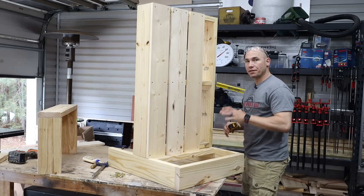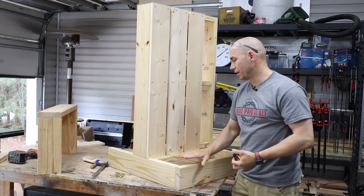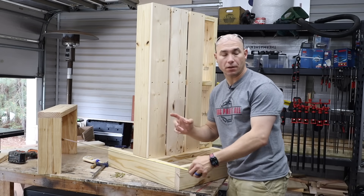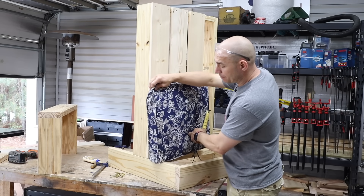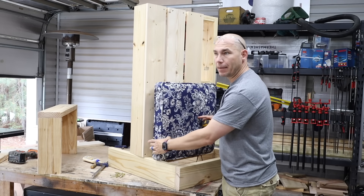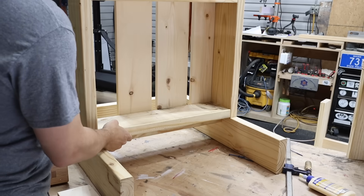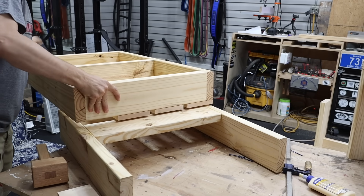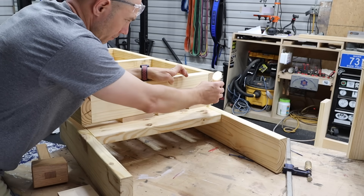So we're going to start assembling the sectional now. This is going to be what's your armrest up top. We want our seat height at 17 inches because our cushions are going to go on there — they're about four inches thick, but when you sit on them they squish pretty good down to about an inch. That'll give us about an 18 inch seat height. I'm going to glue this on and screw it because it's going to be outside. If you glue your joints together, it'll take care of any squeaking and all that good stuff.